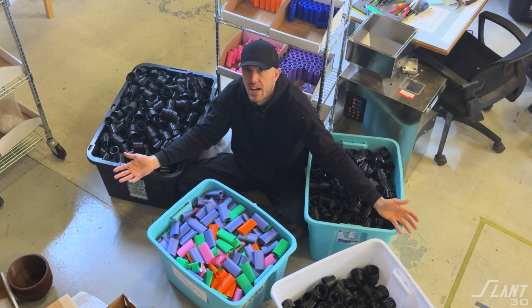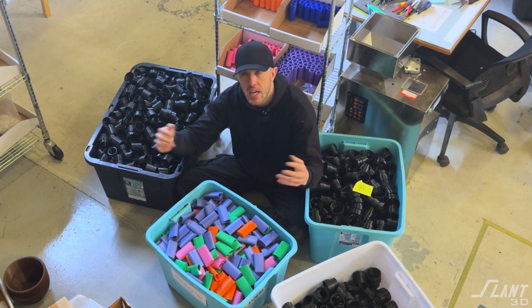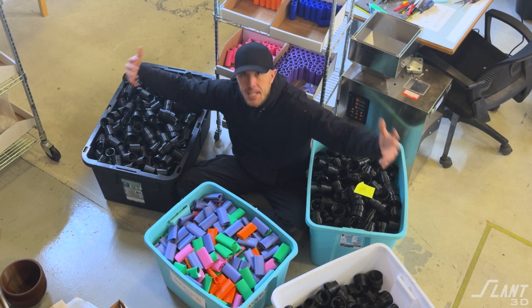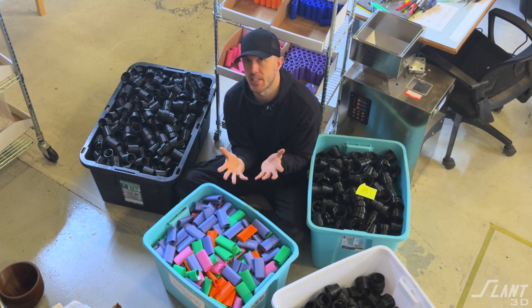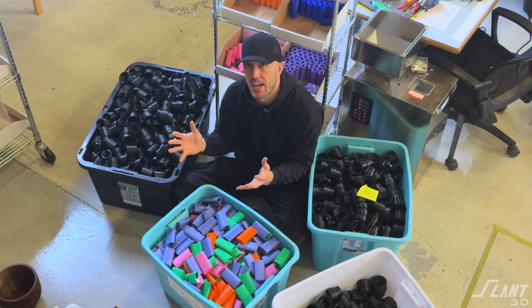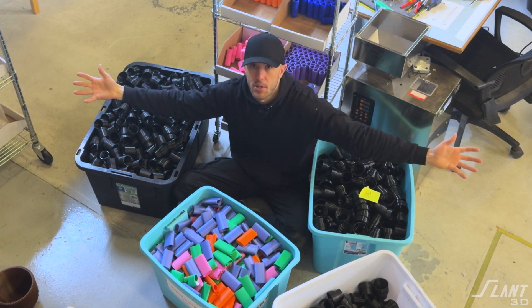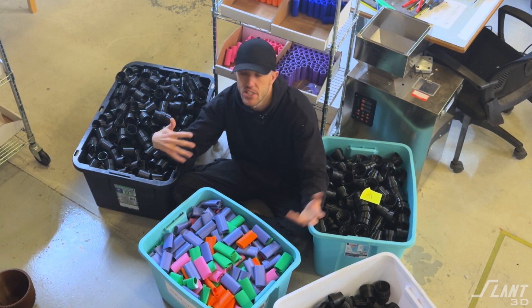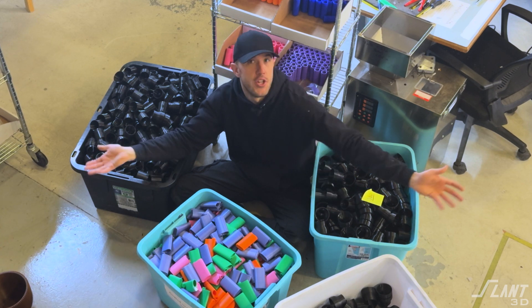You also have to make sure that the manufacturer is qualified — do they have a QC system? Can they verify parts going out? Do they guarantee parts arrive to some standard? This is the challenge with any sort of contract manufacturing. If producing a large batch, you cannot rush it. You cannot simply upload a file and have a thousand parts show up, because they won't be what you expect. You have to have a meeting of the minds where your expectations are met with the capabilities of the manufacturer. This can be pretty efficient — you don't have to buy more machines or a mold — and you can make adjustments during production. But it's kind of like injection molding without the molds.